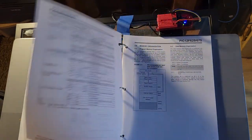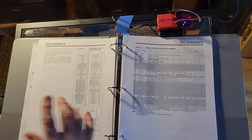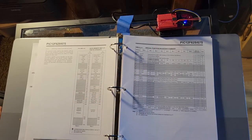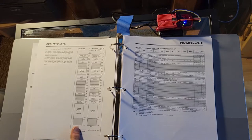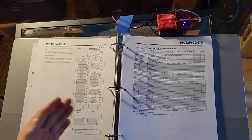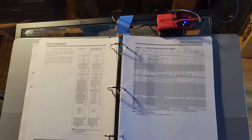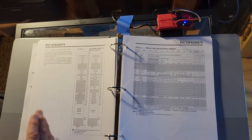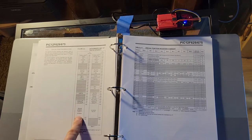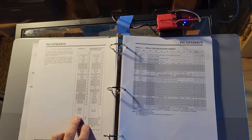This entire 100 pages of information is all you need. It tells you something quite interesting: these microcontrollers run on something called a banking method. There are two banks in this particular microcontroller. Bank 0 has a whole bunch of registers that you can do things with in order to make that chip work, and bank 1 has the same — a whole bunch of registers. Most of them are different from each other, though some are identical, like the General Purpose Registers or file registers, which are all identical — there are about 64 of them. The status register is also the same.